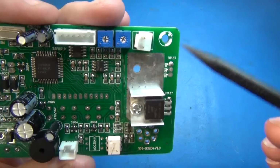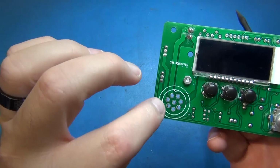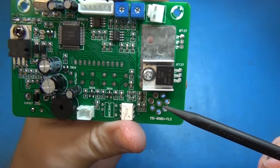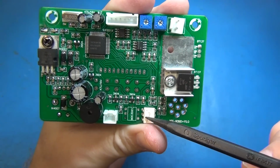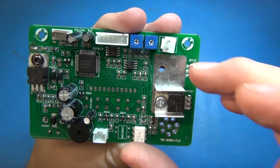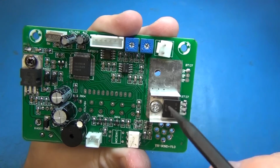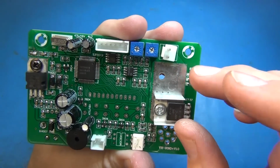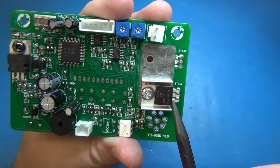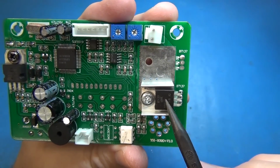It could be that these two wires, even though they go out through two separate holes here, they probably go to the heater together. They probably tap together on the heater element on the inside of the wand, meaning that, yeah, they did have this designed for two opto isolators to be controlled and two Triacs so as to pulse them together, and if they're solid on, then you're dividing and you're getting 8 amps and 8 amps, and you're not going to draw that. You're not going to draw 16 solid amps through those two wires to that tip. But you certainly could draw up to 9.5 amps with the type of ohm resistive heating element that this has.